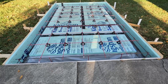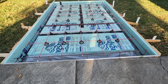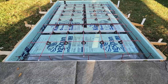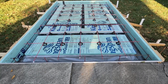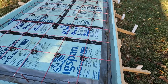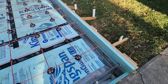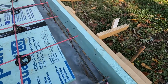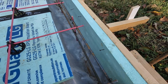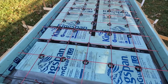Here's the rebar done. I was going to use metal rebar, but Lowe's was out of it, so they had fiberglass at exactly the same price. A little research I did showed it's actually stronger than steel, in tension at least, so I just went with that. You can see I used these little plastic chairs and tied all those together. I did a double layer into the footers. I picked this little trick up from another YouTube video — I put screws into my foam board so that when the concrete cures around it, it'll hold the foam board to the side of the concrete. I just used some old drywall screws for that.